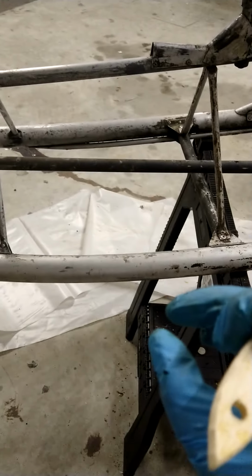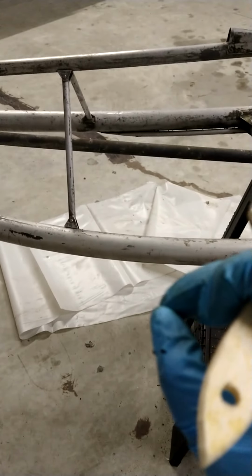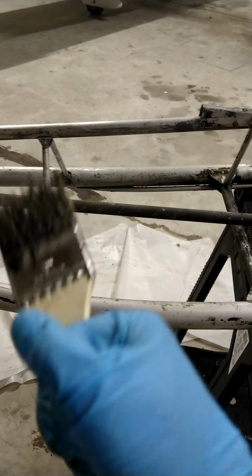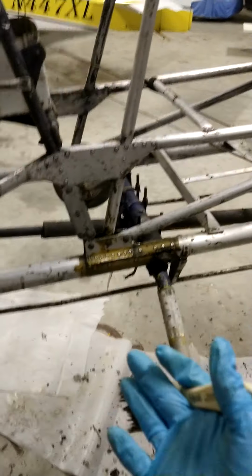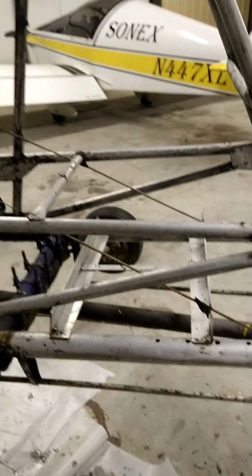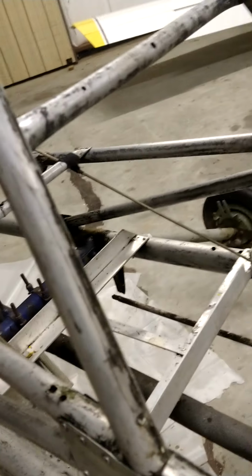And if there's a crack or some sort of structure issue where this dye had penetrated, it's like a light bulb going from off to on. You will see it. It's incredible stuff. And that's how you know if you have a structure issue, or anything that's going to threaten the structure of the aircraft. A lot of aircraft mechanics use it. I don't know how often they're using it, because I never really went out in the field and worked as long as most people have. I had other interests.